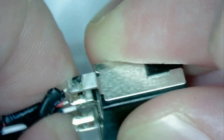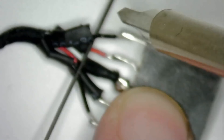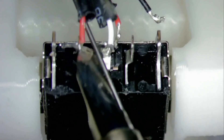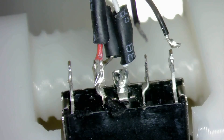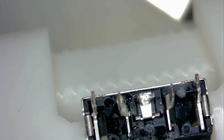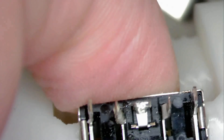De-soldering the wires from the connector is going to be rather easy, since we can just pull the heat shrink tubes from the connectors and then de-solder every one of them. It helps to have a mini-vice when you're de-soldering things — I'll link the one I used in the description. Now that all of the wires have been de-soldered, we can solder them into the new power module.